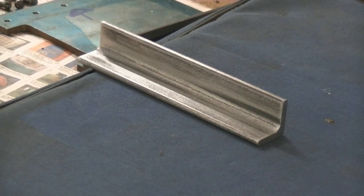And by the time I came back on Monday, I had this greeny brown greasy sludge on the outside of the frames that was almost impossible to get off. So keep it wet, don't let the bloody stuff dry out. But that's the minimum you should get the steel up to before you assemble it, so that the paint will stick later on. And that's another reason why I've got to pull some of the parts apart off the loco before I paint it up, to get the rest of the cleaning up done.